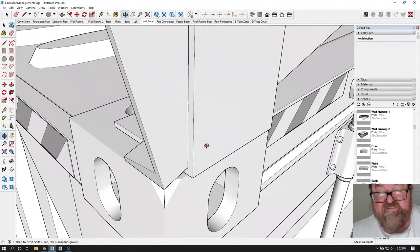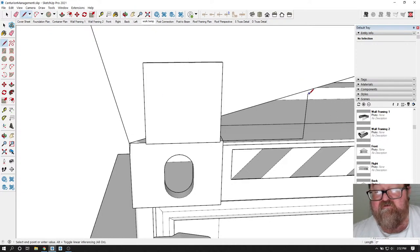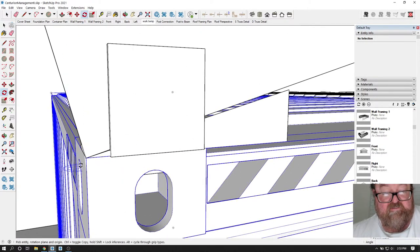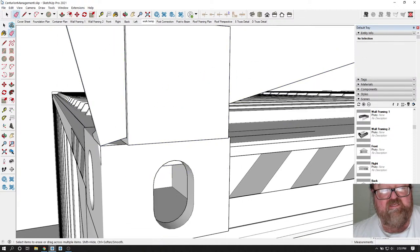We're just in the beginning stages of this, and I'm going to get some engineering help, but in order to do that, I have to have a scope of work. We're going to make our pitch a 3 in 12. I was close, I eyeballed it. I'm just going to bring this down for the fun of it, just to know I got in the corner. There we go, that's what I wanted to see. I wanted to see that face close up, because now I'm going to tilt this channel right there, and that's my 3 in 12 pitch. And now I can get rid of all that.